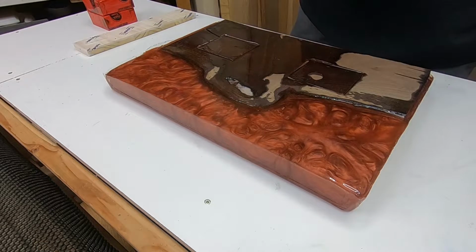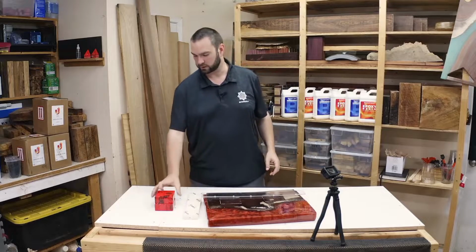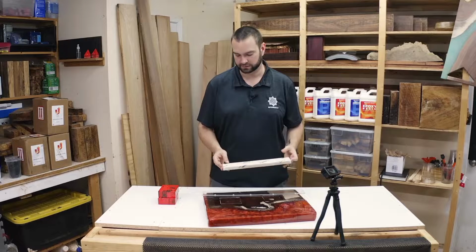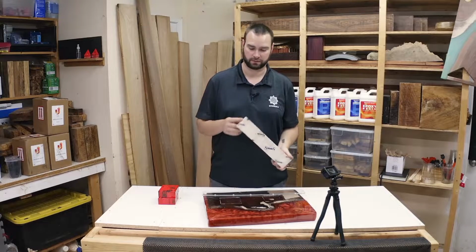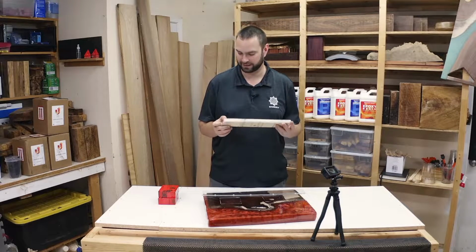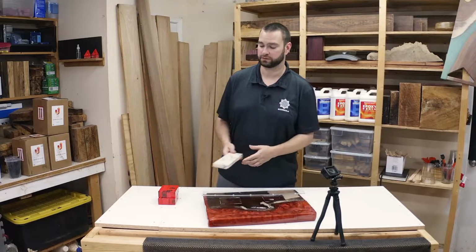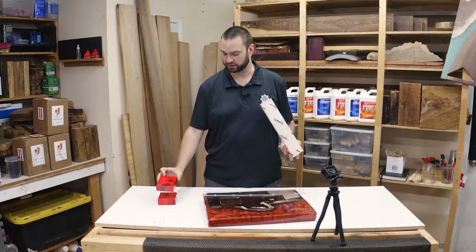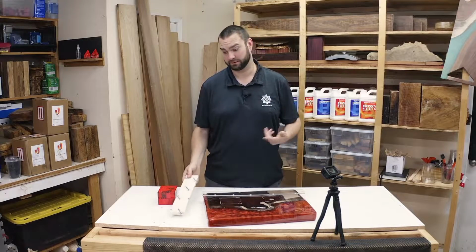But we also wanted to show that we made our mold out of a couple different materials. First of all, we used wood for the base and the short sides, and then we covered it in sheathing tape. Now, sheathing tape goes by a couple trade names. If you're going to the big box stores, you've got Tyvek or Tuck, and they're sheathing tapes. They're all-weather sheathing tapes. Pretty much the only stuff that sticks to this is sheathing tape.